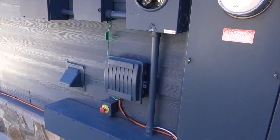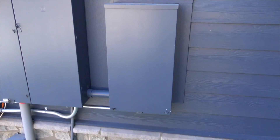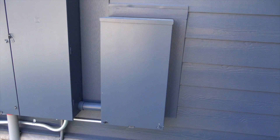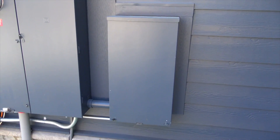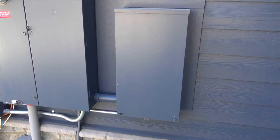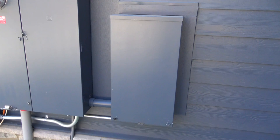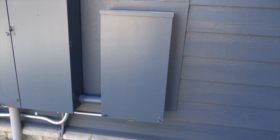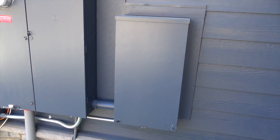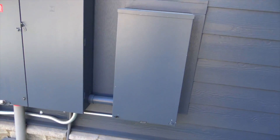In the mech room, there are a couple of other considerations. This house has an automatic generator that is only hooked to some of the critical circuits — it can't run the whole house. It's a Briggs and Stratton system, and in order for us to not turn that generator into a motor and run it backwards, we also have to shut the solar off when the generator comes on, whether it's due to weekly exercising or coming on automatically when the power is out.